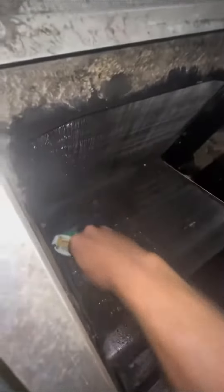Now during maintenance I lightly cleaned the coils — it's not a heavy duty cleaning. This probably would have to get pulled outside and acid treated. But the worst possible thing you can do for an air conditioner nowadays is put acid on it and let it soak with those weak coils. I just cleaned it in place and did the best job I possibly could for them.